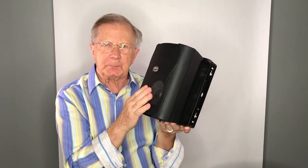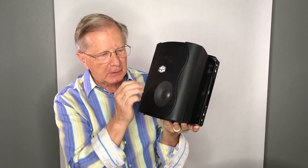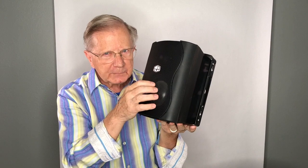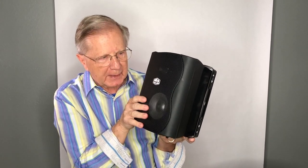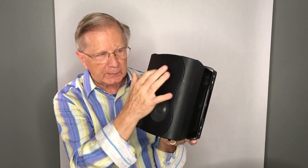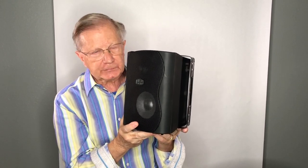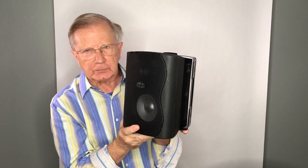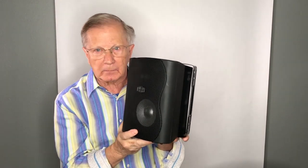The speaker itself is very important. I was a student, so to speak, of Paul Klipsch — he was a great mentor to me. He taught me about speakers and cavities, tuning the speaker to the cavity, and that's what's happened here. It's a 5-inch speaker in a tuned cavity with a 3-and-a-half-inch tweeter. That really punches the 2.5K — so important for mids so you can understand the difference of an F and an S, a P or a B.